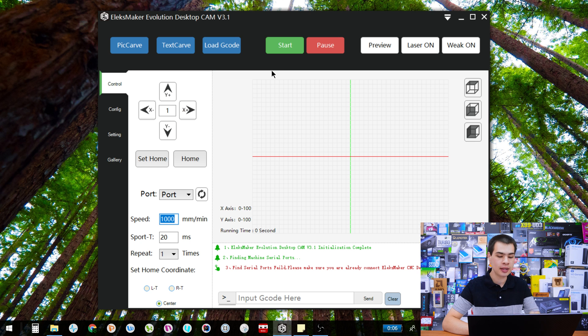When you open up the program, this is what you are presented with. Unfortunately there's not a whole ton of documentation, so you kind of have to work out what all the things do yourself, or watch this video. The first thing you want to do is go down to this port setting and choose your engraver. When you hook up a laser engraver, it will give you the option to select what port it is. The number is totally different from computer to computer — for example on this model it is port number six, but I've seen others with seven, twelve, ten, five, two, or one.